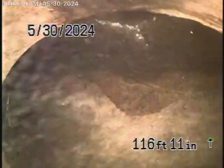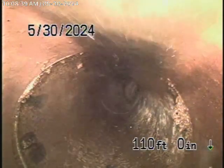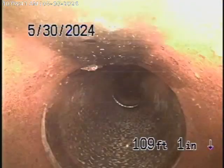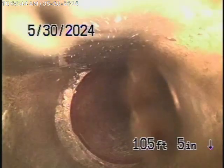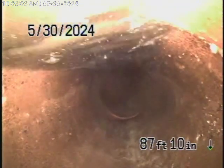This is a big 6-inch clay pipe coming back from the middle of the street towards the property — it's a very long lateral. You can see a little shift in the line, but nothing serious. Remember, this is all based on my opinion; a public works inspector may have a completely different opinion. But this is a big 6-inch clay pipe that so far appears to be in pretty fair condition.